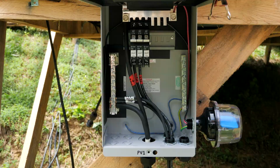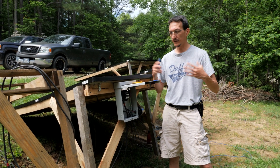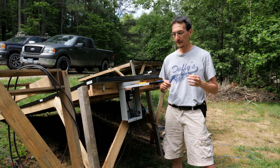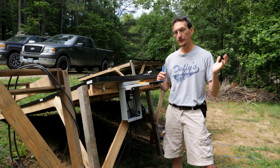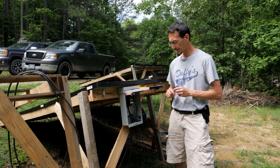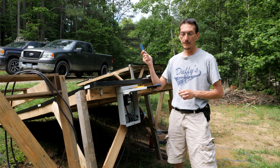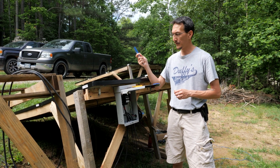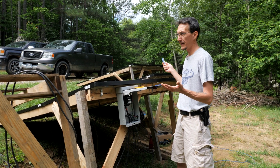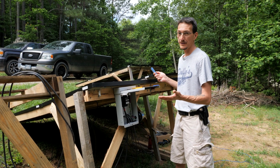In our video on batteries where we talked about watts, amps, volts, resistance, and things like that, I didn't touch on voltage drop, which is a big issue when you're trying to push a voltage over a long distance, especially when you're running DC power. Our panels are 130 feet from our battery bank and our charge controllers, because this is the only place that gets the most amount of sun during the day, and so we had to figure out what's the trade-off there, and this is the best place to put them.